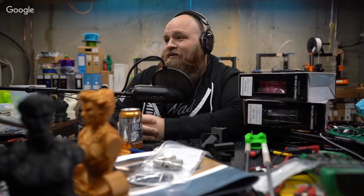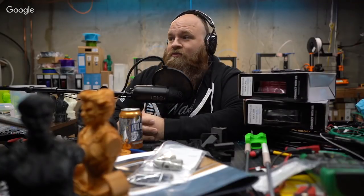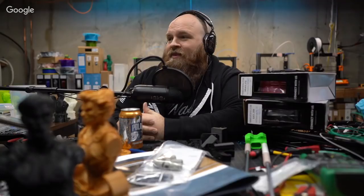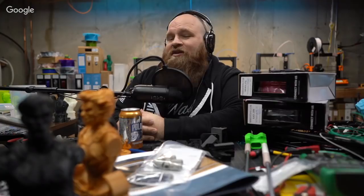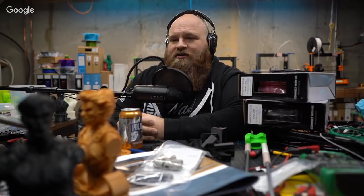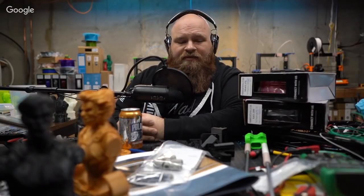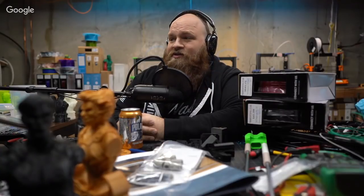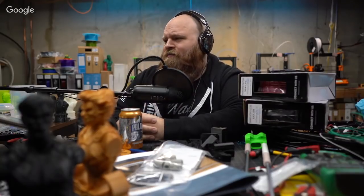Oh man, you can't access the grub screw? Did it get stripped? Because normally it gets really tough with those tiny little set screws. Don't ever use a ball head on those tiny grub screws because it tends to strip them out so quickly. So I just use the regular one that came with the E3D V6. If that's what happened, I have no idea because you haven't said.